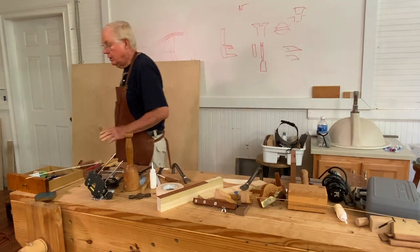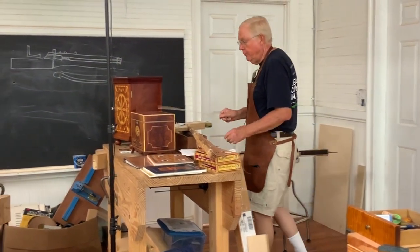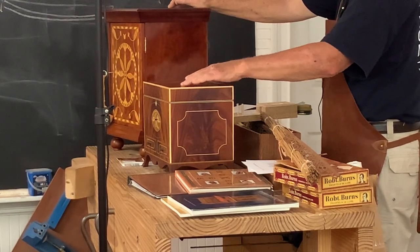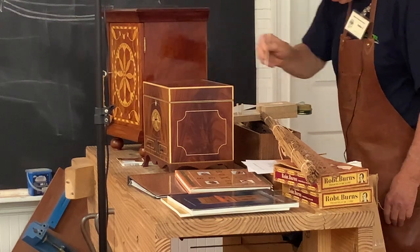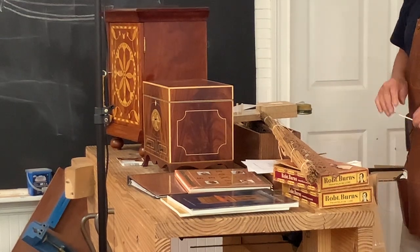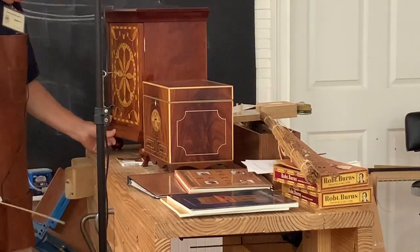I didn't bring something with me, but I will tell you about it. I made this probably 15, 20 years ago. I've had it for a long time. It's one of the first things I ever inlaid a lot on, and I learned a lesson. When you come up here and look at it, you'll notice that the veneer has come loose right here along the seam. The reason is I didn't get good glue coverage. I've got a bubble right here, and a tear right there. When I made it, I didn't notice that. It's happened over the years. But I don't worry, because I've looked at antiques. They all look like that. They've got some flaw in them. I don't worry about flaws or dings. This thing's been dinged up. It sits in my hallway when you come in the front of the house, under a hunt board, and it's been hit by the vacuum cleaner several times. But I don't care.